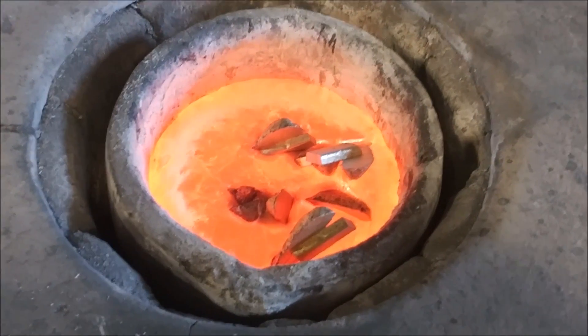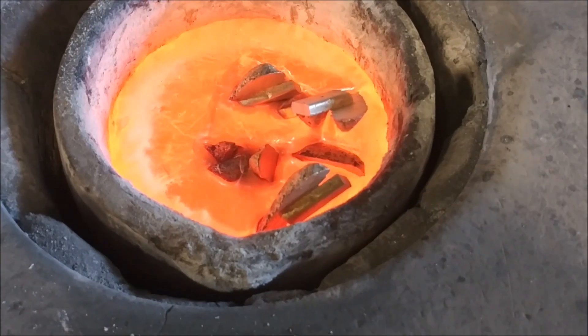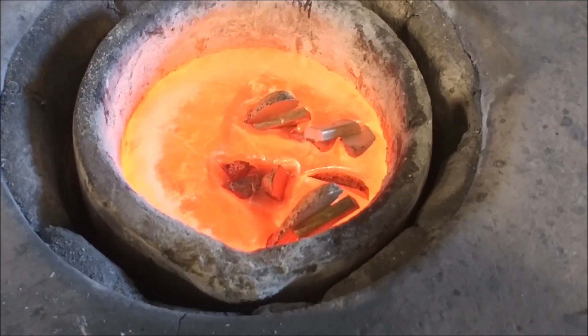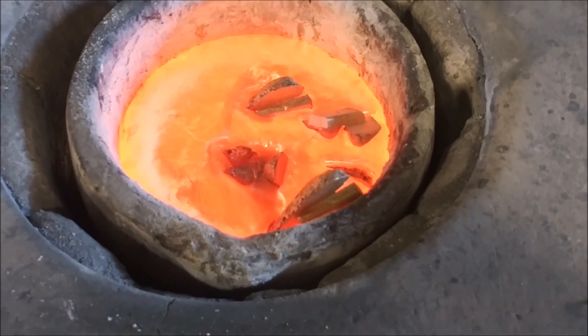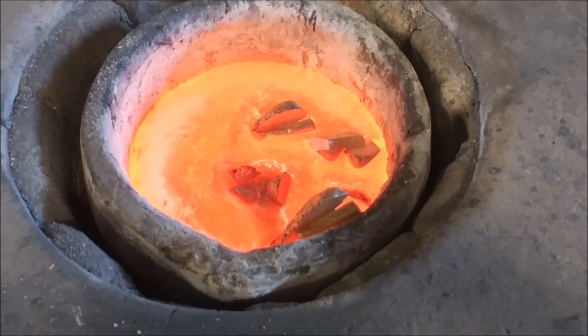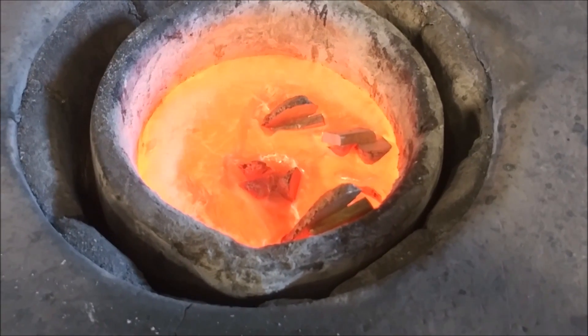Right before we're about to get a full pot here — you can see the cut-off gates and sprues. We can recycle everything in our process so no material gets wasted, even if we make a mistake. It's getting up to temperature now. We may add a couple more ingots to get it pretty full, and then we'll get it up to temperature and pour it.